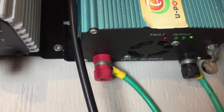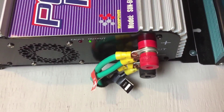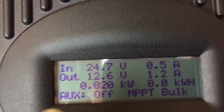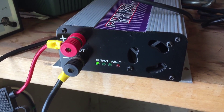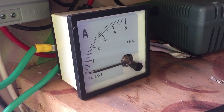The lights are moving but that doesn't mean a whole lot. It's just kind of freaking out. There's our battery bank at 12.6V - we're getting a whopping 1.1 amps, 20 watts. The 265 watt panels there on the post are still hooked up to the little 300, lights are moving but there is nothing coming in. Brutal.